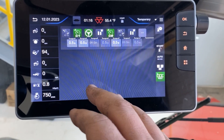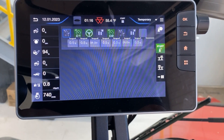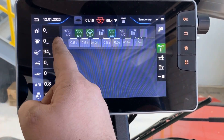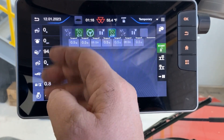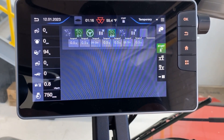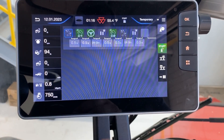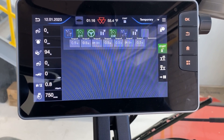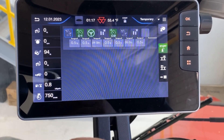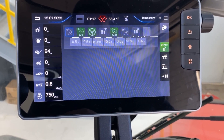So how this is going to react in the field: if I hit start on the right-hand side and hit and hold, it's going to play through our first sequence and then it's going to pause. Then if I hit and hold F1 again, it'll play through our second sequence. It is important to note that we have to have two pauses in each headland when we're doing an in-field and out-of-field sequence. That way we have time to operate the tractor when going through the field or making our turn at our headlands.